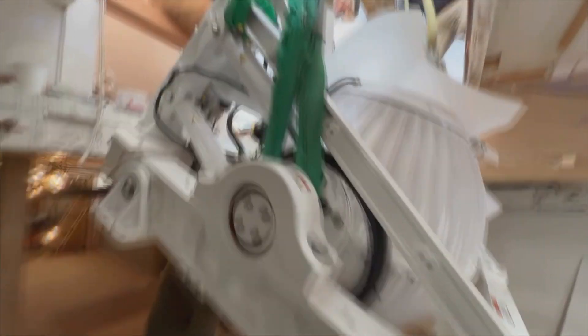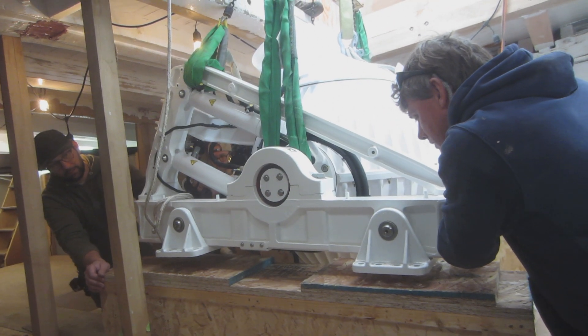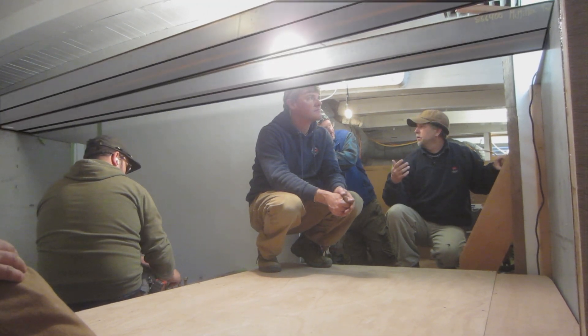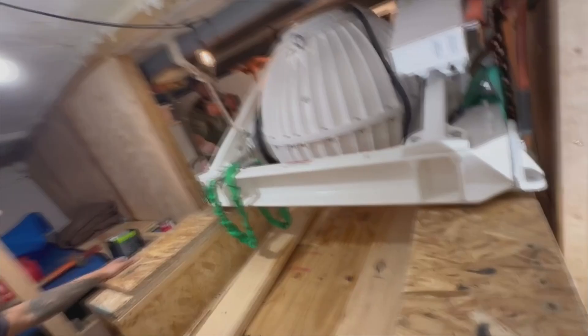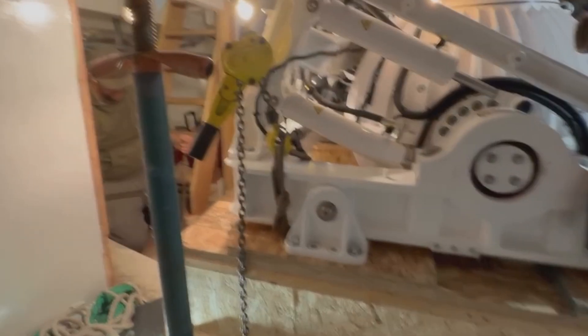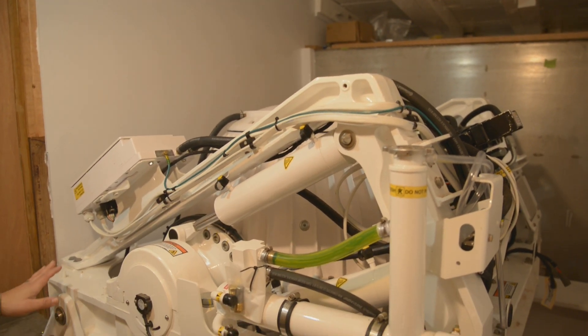We lifted it up square but in a way that we could tilt it slightly to get it through the hatch. The opening in the doghouse on the main deck is only so large — just like the engine, it had to tilt a little bit to get down the hole, then once it was below we could square it up again and set it down on the wooden cradle it shipped with. We then had two big I-beams braced off the tops of the water tanks, lifted it just high enough to take the pressure off its crate, slid the crate out, set it on blocks, and used beam trolleys and chain falls to roll it across and lower it down onto its mounts.